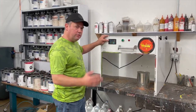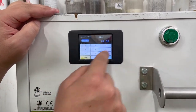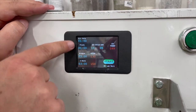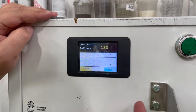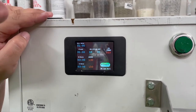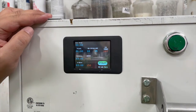Everything on this is just touchscreen. If I want to set a program, I just touch it and select whether I want to adjust it in minutes or seconds. So if I wanted to do a minute and 20 seconds, I'd enter that and save. If I want to clear it, go back to a minute, save. Same with each of these — that's my heated flash, save, medium wave, short wave. I touch my set point if I want to change the temperature. The IR temp is always showing you the temperature the laser is reading — I'm putting my hand under there so you can see it's reading me. The cycle on/off time for the heated flash is how many seconds on and how many seconds off for the pulse.